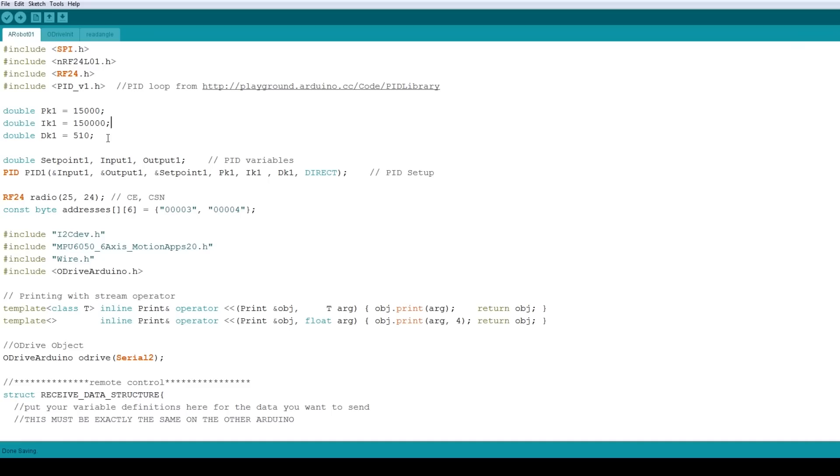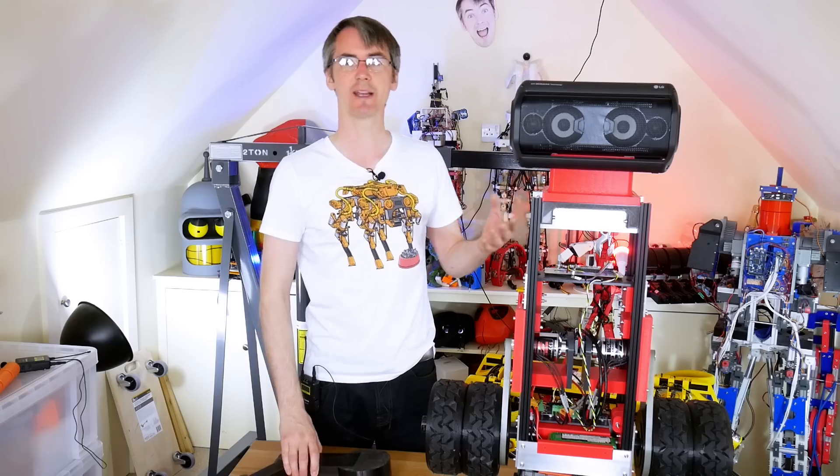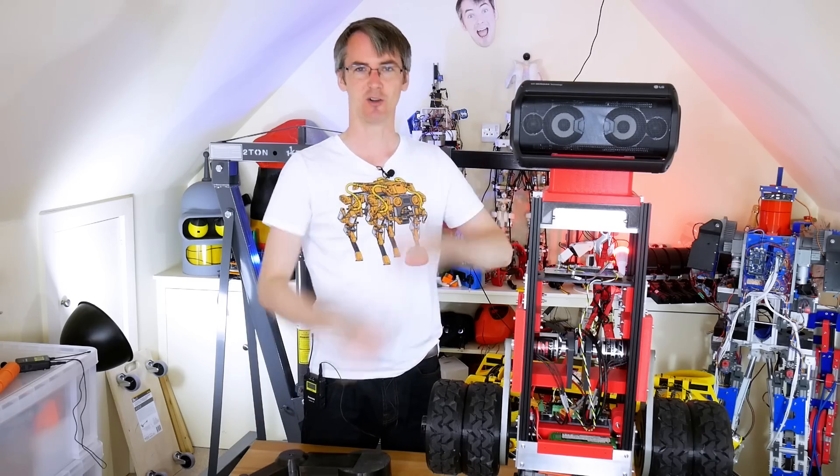For anyone interested in my PID values: for balancing robots I typically want an I value that's extremely high - normally 10 times that of P - because I helps the robot accelerate towards its target quickly to catch itself. You then dampen that down with a D value, which you experiment with. These values are really high because the ODrive encoders are 8192 counts per revolution, so you need a lot of amplification to get the required velocity. That's the end of part one - come back for part two where we'll put on motorized arms, make a controller to drive it around, and see what we can do. Thanks again to LG for sponsoring this video with LG XBoom Go speakers.